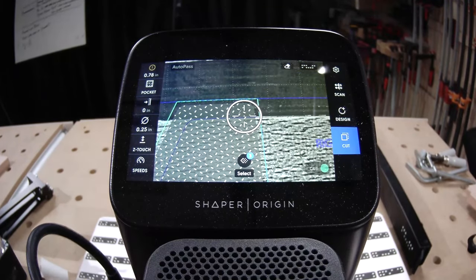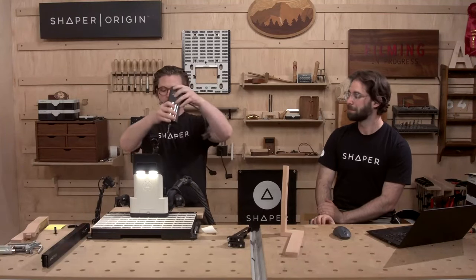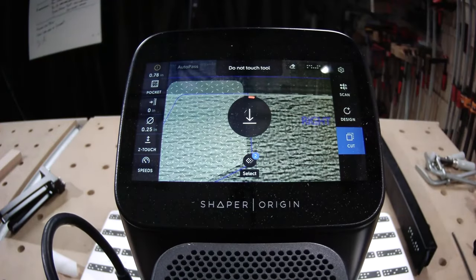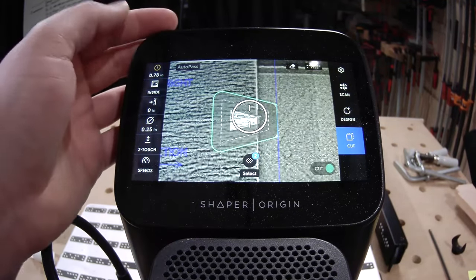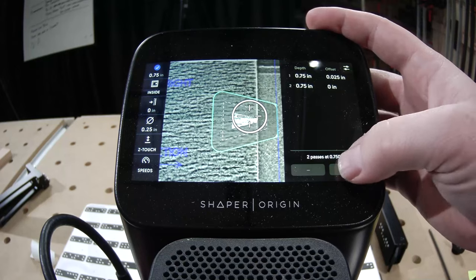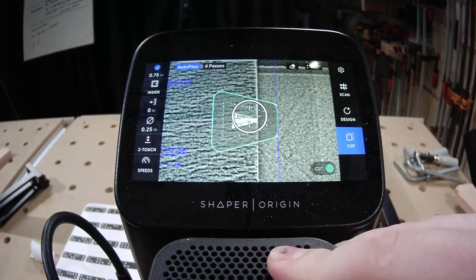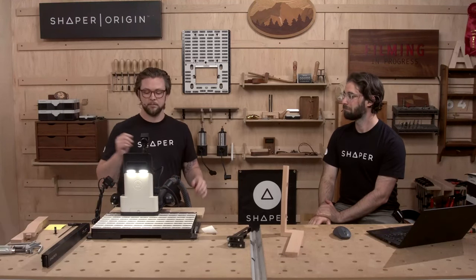All right. Swap back to my quarter inch bit. Good practice is always to Z-touch. Okay. Nice, simple little shape here. We're going to cut it down to 3/4. I'm going to use auto pass. Add a couple steps here. Sweet. Let's do it. I'm going to cut it to 0 offset, test fit, and then probably fine tune it with maybe a 3 thou. Cool.